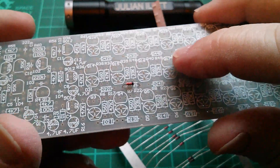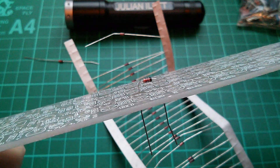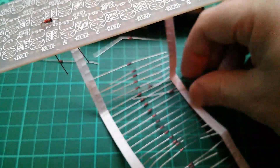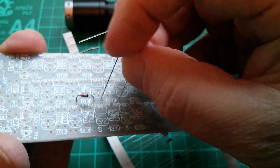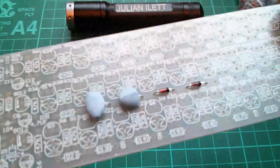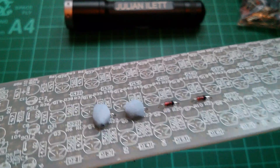When you're putting components in a board, the difficulty is how do you stop them lifting up out of the board when you turn it upside down to solder? One solution is to put a soft bend in the component lead so it wedges itself between the holes. That didn't work, so I've had to use blue tack. I then got my bend radius about right to match the board and now the ones I'm putting in are staying in.